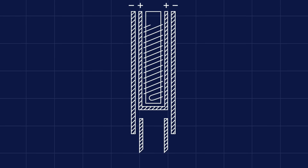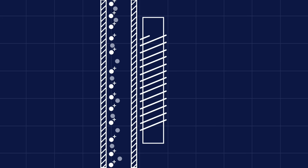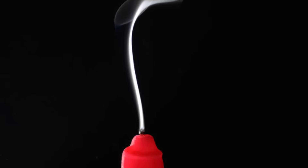Rice's design consisted of two concentric platinum cylinders across which an electric potential of around 300 volts is applied. The anode cylinder is heated to around 1000 degrees Celsius by a platinum or nichrome resistance wire heater. His original design was intended to detect a wide variety of substances, with the detection action based on the work function — or ionization potential — of the substance being detected: how much energy it takes to strip away an electron and turn that atom or molecule into a positively charged cation. If a substance has a lower work function than platinum, it will be ionized by the heated anode and, being positively charged, drawn towards the cathode, creating an ion current that can be detected and amplified. Rice gives the example that light wood smoke or cigarette smoke, which contains alkali metals like sodium and potassium, are easily detected since alkali metals have work functions lower than platinum.